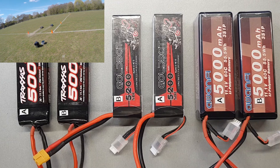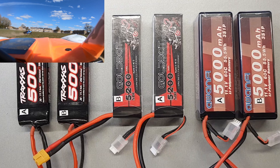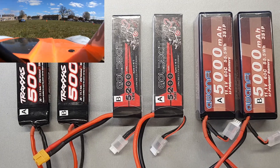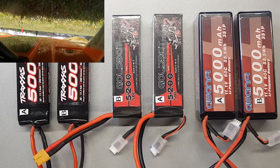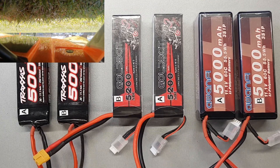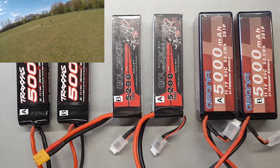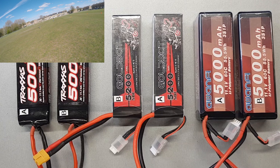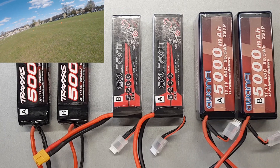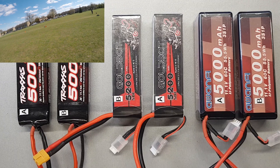What we've done is a 10 amp charge on them and measured the internal resistance. The internal resistance is how much punch you'll get from the battery — a lower internal resistance gives you more punch. It can also indicate a failing battery as it starts to rise. We then did a 20 amp discharge to see what the run time is like.